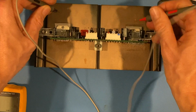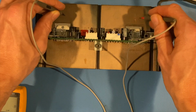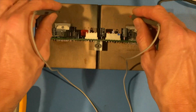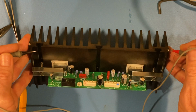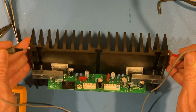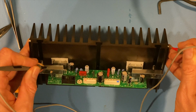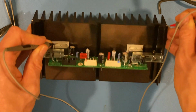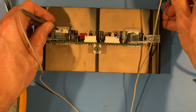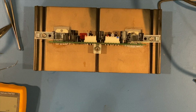But if you just try to go like this, you're not going to get it. The black anodized that's on there is going to block your conductivity. So you got to go into the screw housing here, the screw thread. So you can go screw thread to screw thread. Could even go here, but again, you got the black anodized in the way. You want to really be sure you go into the screw thread, and then housing, good to go, no connection.